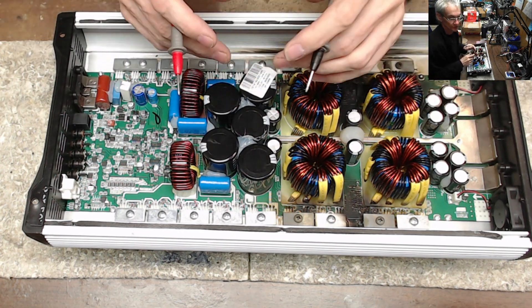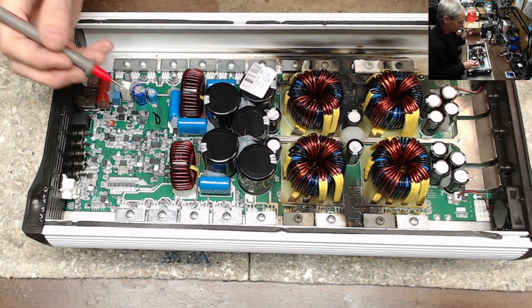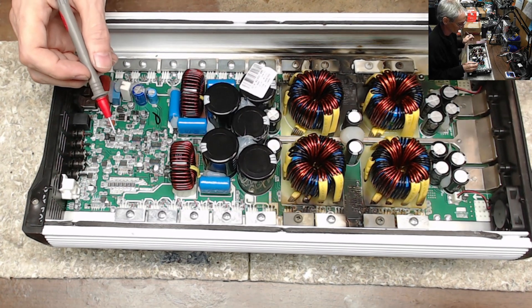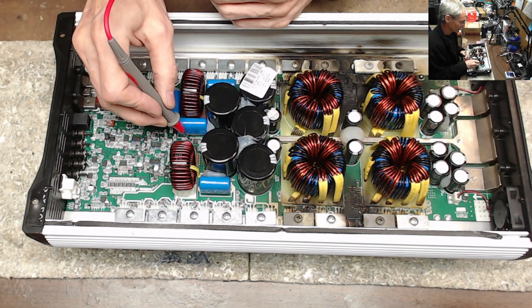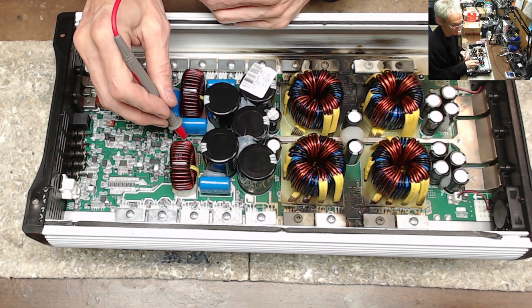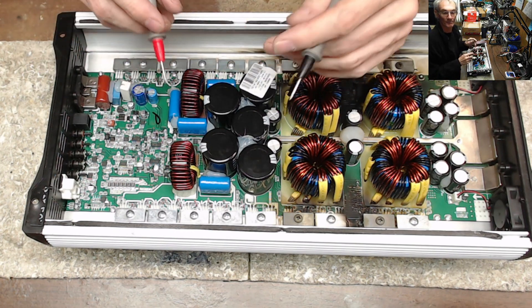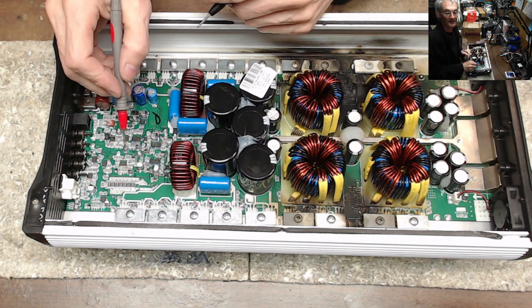That is something I will address when I tear this apart. When I strip the power supply, I will pull the ICs and bump the remote. You will see tiny quick pulses coming from the PIC to drive these drivers. If you don't see both those pulses — you're going to have two of them — then your PIC is damaged, and then you're going to have to contact me.